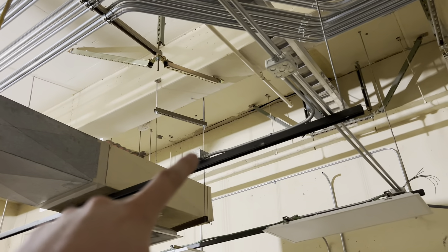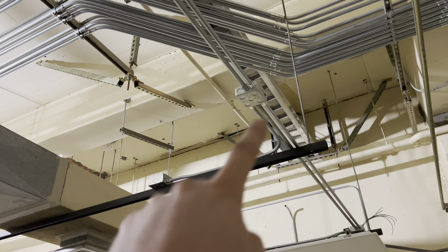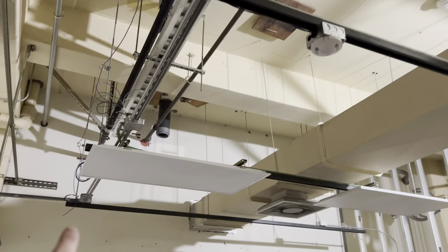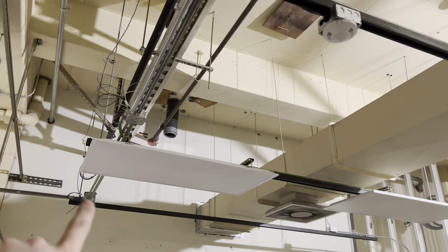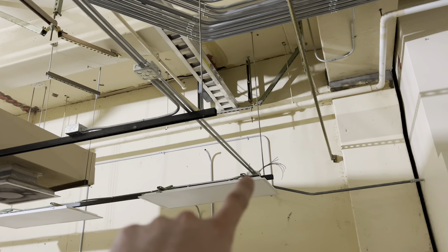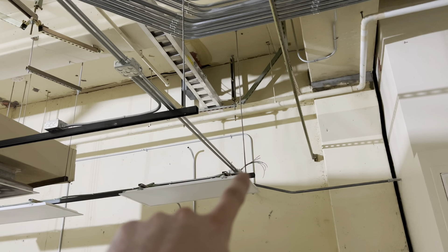So I'm going to pull circuit 30 because that has to tie into this box — this little box we added today, between this box. And then pulled in the new wire from there to the end for the black, white, and ground for circuit 32.